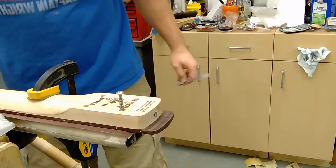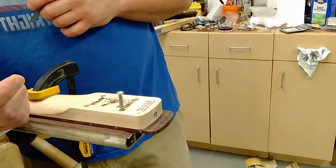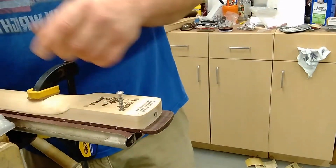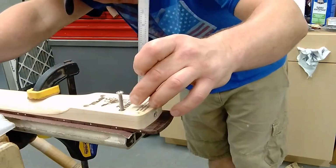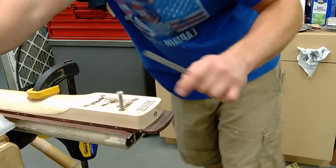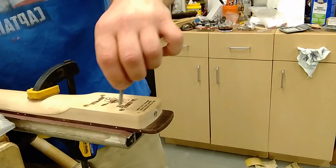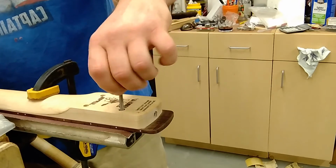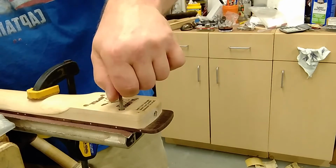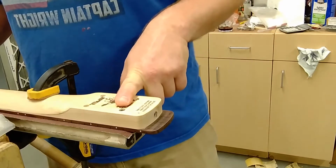Top of the dome looks like 1 1/16. And then you add 3/64, so 1 7/64. The neck pocket, you add the plate, you add the meat underneath the neck pocket. This is never going to bottom out like this. And see how nicely it just spins in there? And it's strong. That's how you install the Vintique neck insert.